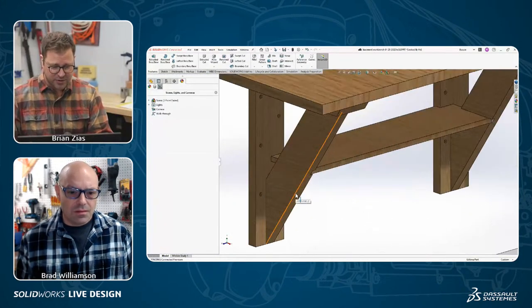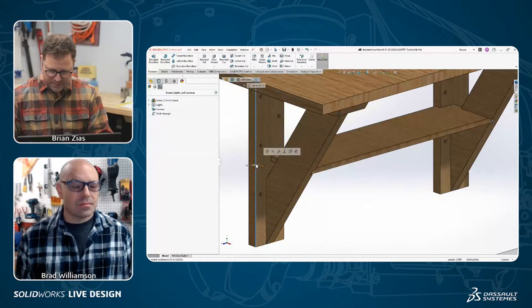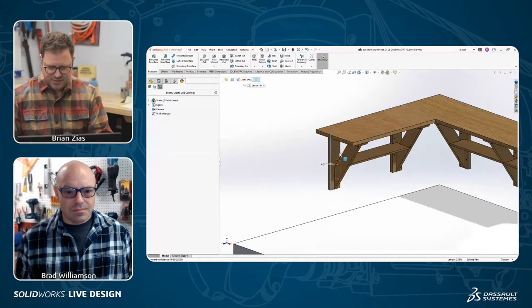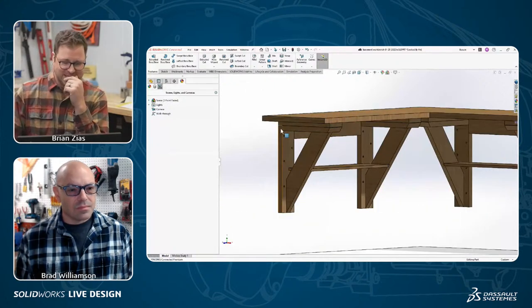All I did was use that little trick where you select an edge and you see down there 2.4 feet. So I'm like, I need 2.4 feet plus 2 feet. That's about a 6-footer, times 5, 30 feet. So 5 6-footers plus these. I just tallied this up and ended up getting like 10 2 by 6s.